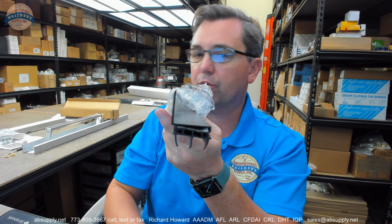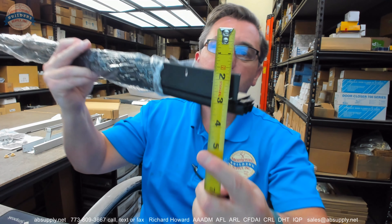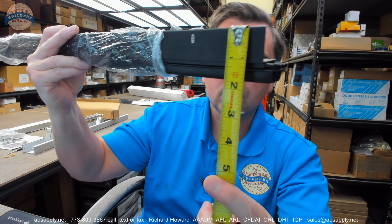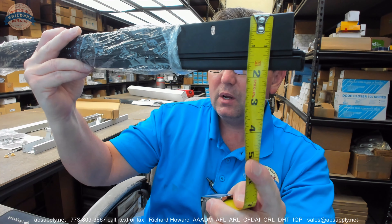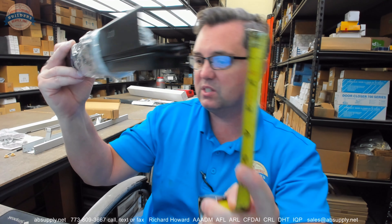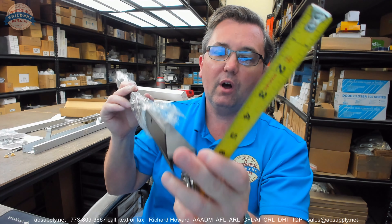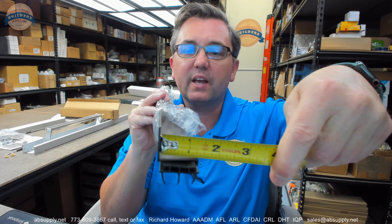The 2113 is representative of this item and its dimensions and its insert. Let's tackle the dimensions first. The overall height of what would be the interior is about an inch and a sixteenth. The overall height is an inch and three-quarters because you have eleven-sixteenths worth of that insert — eleven-sixteenths. The insert is one and nine-thirty-seconds of an inch, so just over an inch and a quarter.